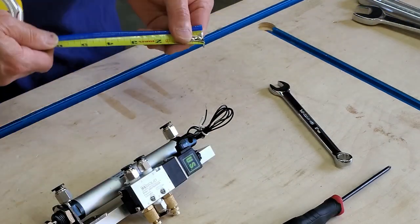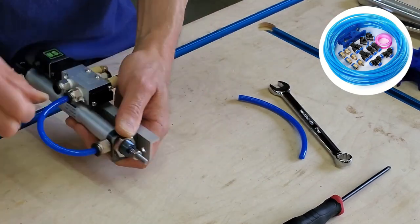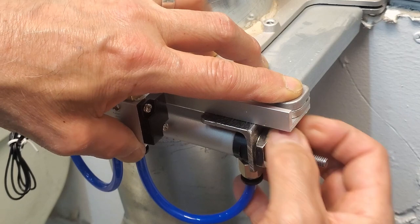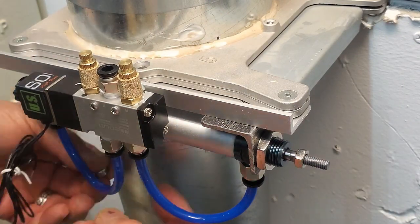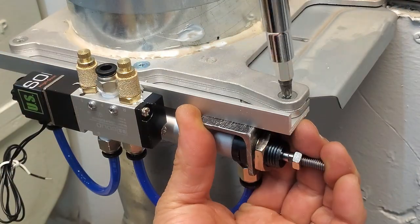This is 6mm OD, 4mm ID polyurethane hose. I bought this in a kit that came with 10 meters of hose, some miscellaneous fittings, and a tubing cutter that turned out to be a lot handier than a utility knife. As I added these gates to the rest of my shop, I ended up needing a lot more hose and fittings. With the bracket finished, I'm mounting the pneumatic cylinder and solenoid valve to the blast gate.